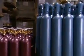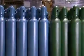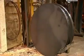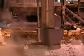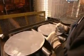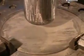These cylinders are made of a steel alloy containing chromium and molybdenum. Their manufacture begins with discs that have already been heat-treated at 730 degrees Celsius for 36 hours. Now they go into the first of 5 hot chemical baths that will help the metal flex. After a quick drying period, each disc moves over a die.